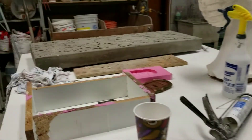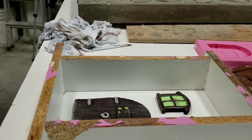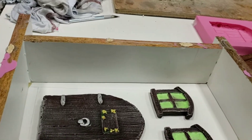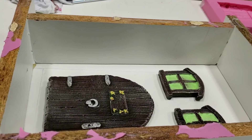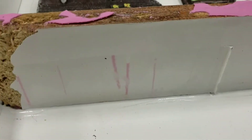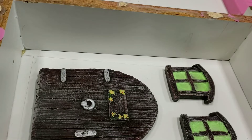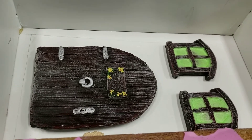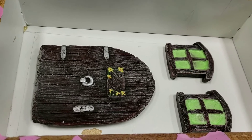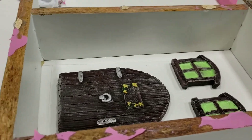So what you're going to do is make your mold box — your little frame. You don't have to be exact size. I just take these random pieces of melamine, slap them together. I put a little bit of hot glue on the pieces just to stick them down. I silicone the corners so it doesn't run out and the bottoms on the outside so you don't get any overage. They recommend you use a release on the box and the pieces. I use Smooth-On's MAN release — unfortunate name, but it works really good. Evaporates really fast so your mold's ready to go.